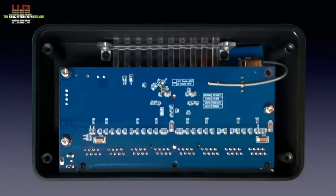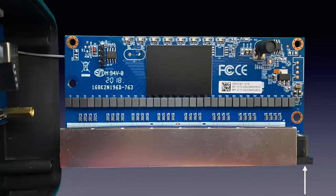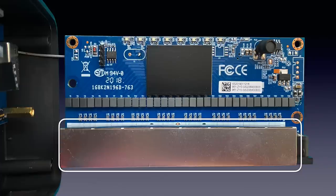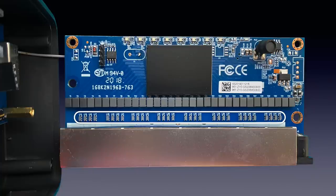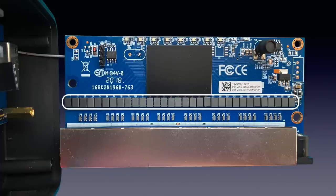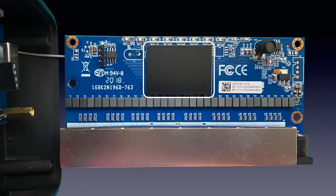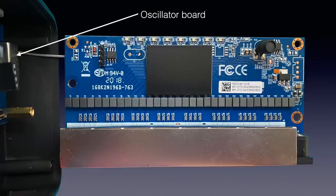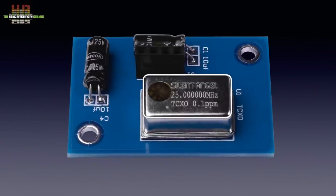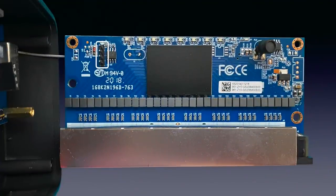Since the housing is machined from a slab of aluminium, the circuit boards become visible through the bottom opening after removing the cover. Directly behind the power socket there is some power regulation. Then the network sockets with directly behind them four inductors per socket. A network cable has eight strands that per pair carry a signal; the inductors filter out high-frequency noise from these signals. Behind these filters are 32 small transformers that provide galvanic separation on all eight network ports. Under a black sheet that fights stray magnetic fields, the microprocessor is hidden. At the clock oscillator position, a thin HF cable is soldered to islands that lead to a small board still inside the housing. It holds a high-spec temperature-compensated clock crystal branded Silent Angel, specified at 0.1 parts per million.